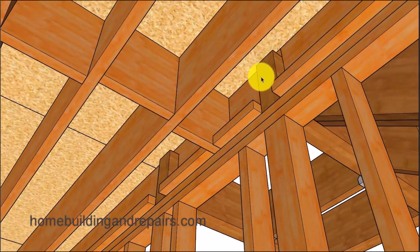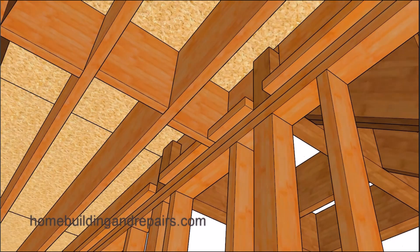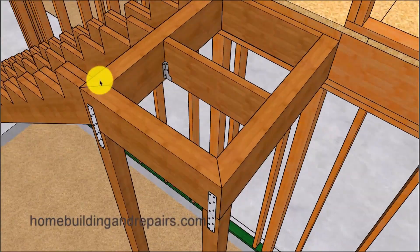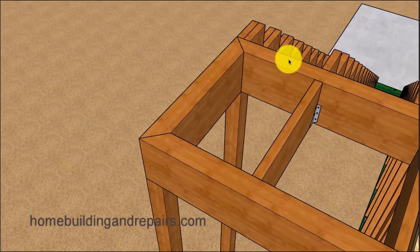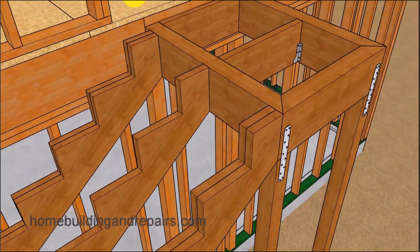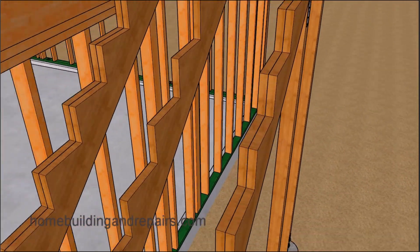Here's a version of the beam flush with the wall, providing you with another way to build something like this, along with our double stringers and mitered corners. The double stringers will provide a little more structural support, and the mitered corners will provide another way to finish off this part of the stairway with the beam sitting on top of the post. Let's take another look at the stringers — even though I didn't provide one in the center, you can always double up that one also.